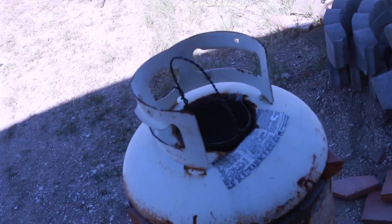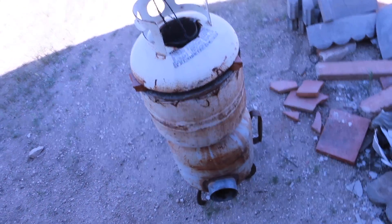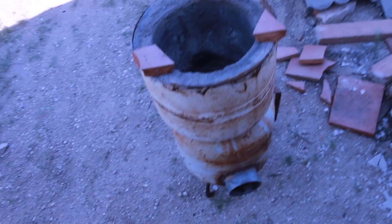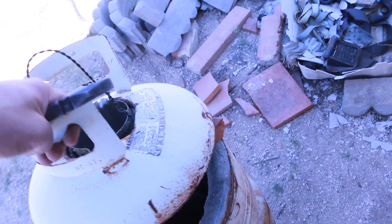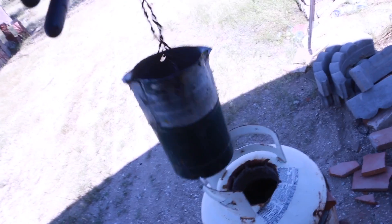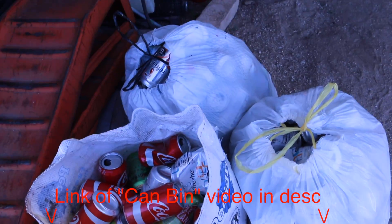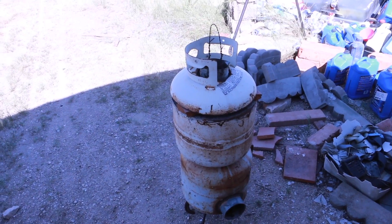Here is a furnace I built a while back. Unfortunately I lost all my footage for this project — I think I forgot to film a lot of things. But either way, here's the furnace I'm gonna use to melt the metal. I made it out of basically a couple of propane tanks. It's got a rocket stove design with a pipe that goes down and out the bottom, and a smaller propane tank inside for melting the metal. I'll also put a fan on the bottom to pump air up and out. I'm gonna melt down some aluminum cans from my can bin to use for this project.